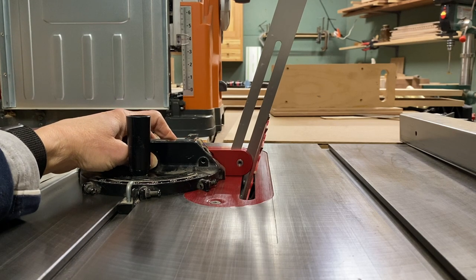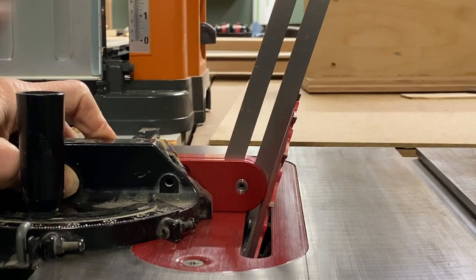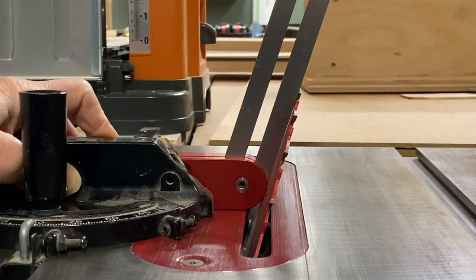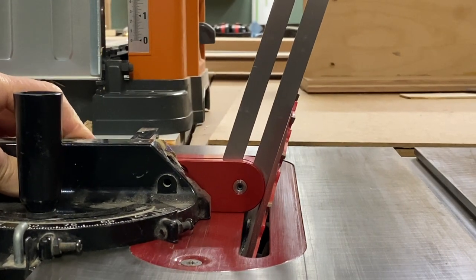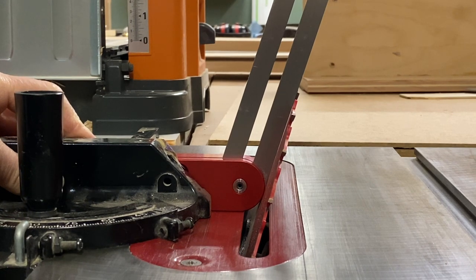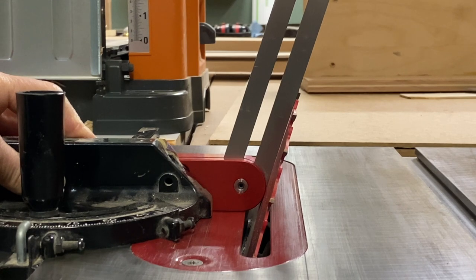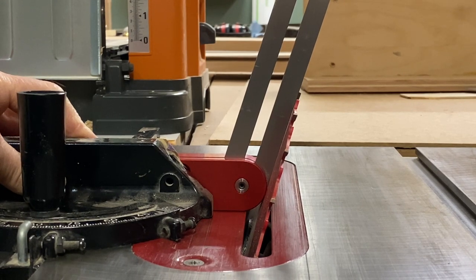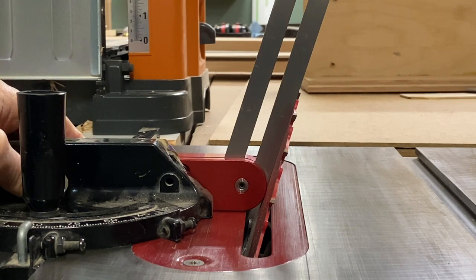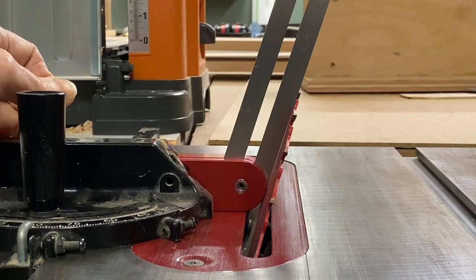You can see I have a little bit of an air gap. The table saw is unplugged right here, and I want to clear that away. You want a point at which the blade is not contacting a tooth. I just have this fine adjustment to make here. That looks good — this is just a reference point. I don't see any air gap between the blade and my bevel gauge, so that's what I want.